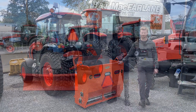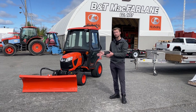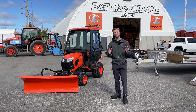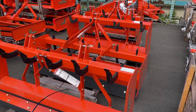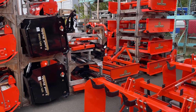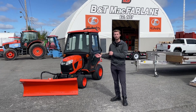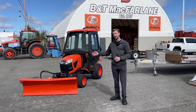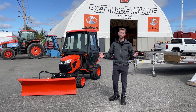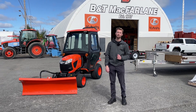The last piece of snow equipment works in conjunction with having a front blade or front snowblower. Basically any front snow removal attachment works really well with a rear blade or rear box scraper, because front attachments only work so well — you can't really pull snow away from your garage doors or obstacles. But if you have a box scraper or a rear blade, you can set that blade down and pull snow away from your garage door, then come through after with your front blade or front snowblower.